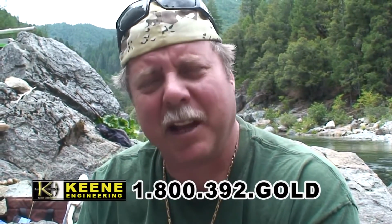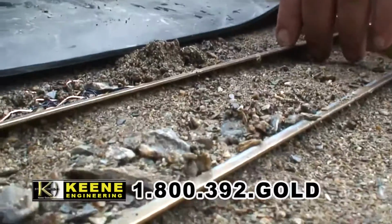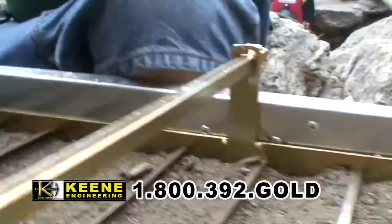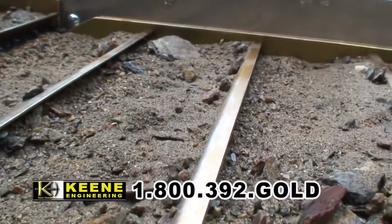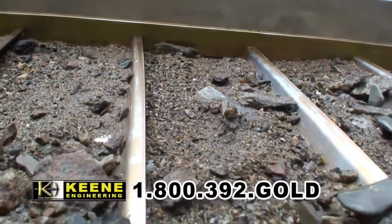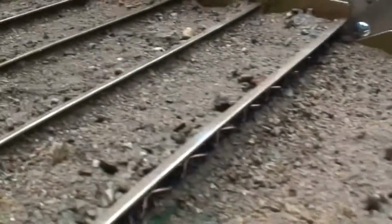We've made them up to 24 inches wide. It really just depends on the application and the size water pump you're going to use. That's about a 1/2 inch height riffle, and we split it up with 1/2 inch and a couple of 3/4 inch. One thing we've found out is that when you break up the flow, going from short to tall, it actually helps the box work. From our experience and our testing, this is what we found out.